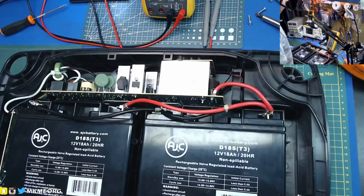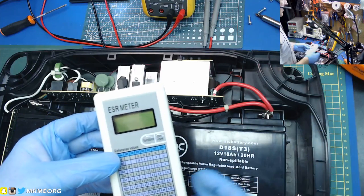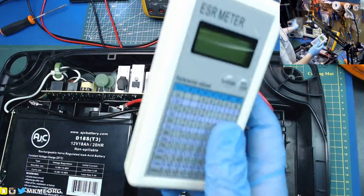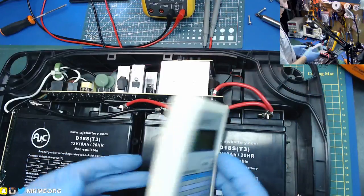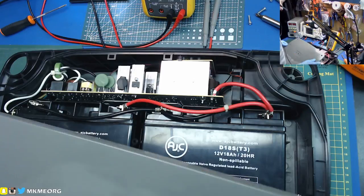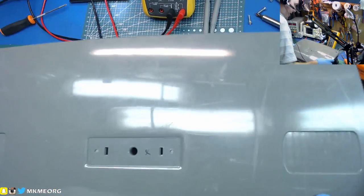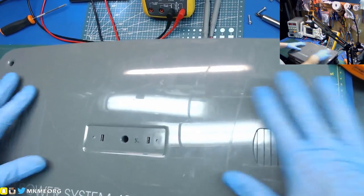It's always the caps - heat is why they dry out and fail, but it's also a neat little diagnostic tool. If you want to do it the right way, get yourself a cheap ESR meter - these things cost nothing and it works easy. This one I love because it has a tweezer setup - just discharge the caps and put it on. It's almost always electrolytic caps. When I made the joke about fish oil earlier, I wasn't kidding - a lot of caps, even good production ones, the electrolyte was actually fish oil, and some of the cheap ones had bad fish oil.